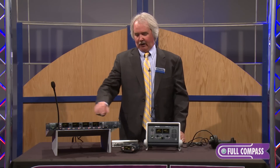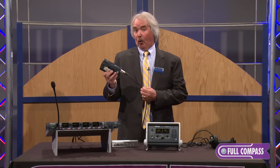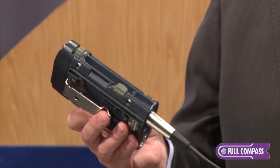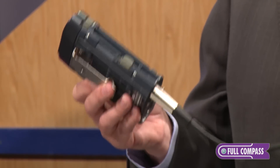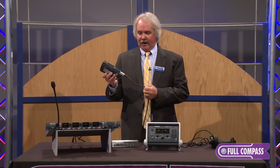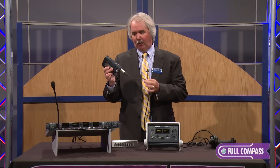The main difference is those four channels — A, B, C, and D — ride on a single microphone cable, a single piece of shielded cat cable, or a 40-year-old piece of existing Belden 8451. As long as the cable is continuous, shielded, and within certain length parameters, we can provide four individual discrete intercom channels on a single cable.